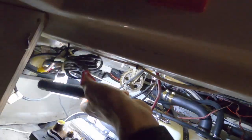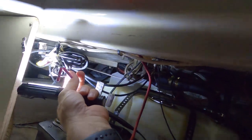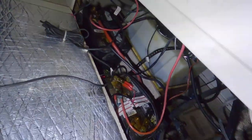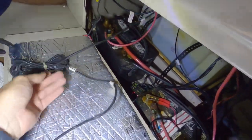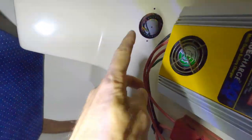I'm back in here trying to plan everything out. First thing I'm going to do is get all these old autopilot wires undone and look at what the labels say, because I should be able to reuse the power and the line going up to the original drive unit. It's just a two-wire and that will drive the new unit also. The person who installed it labeled it 'wheel drive' here, labeled it 'wheel drive' here, and then four inches away labeled it 'wheel drive' here again — nice job whoever put this in.